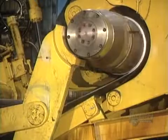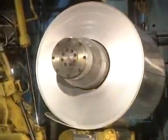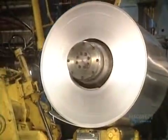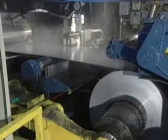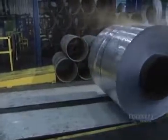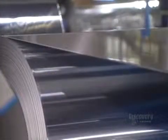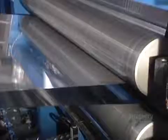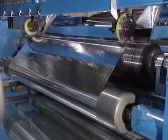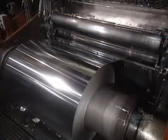The sheet is sufficiently thin to proceed to spooling, where it spools onto itself before being sent to the cold rolling mill, where its thickness will be reduced still further. The aluminum sheet has become very thin and risks being broken by the tension needed for cold rolling, so the sheet is doubled to avoid breakage. One final reduction in the mill and the sheet will have the thickness required by the customer. A liquid coolant is used to prevent the foil from sticking to the rollers.